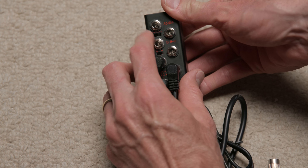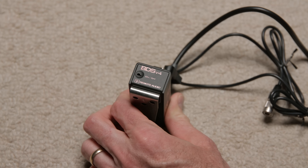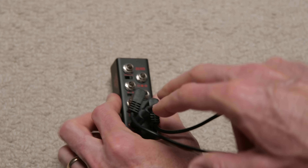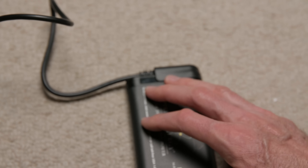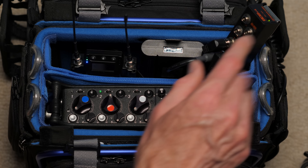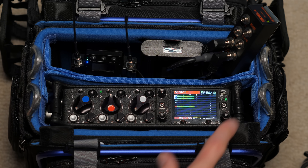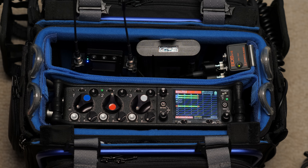A couple of other features: you can tell the BDS what type of battery you're using — whether it's lithium ion, lead acid, or nickel metal hydride — and it uses the color of the switch to indicate battery status. I also have a readout showing four out of five segments remaining. There's a switched versus unswitched output port, so when you turn the switch off, that unswitched port still gets power — I have my mixer hooked up to that, so at lunchtime I can keep the mixer on to retain timecode without running the wireless. It also prevents overloads and is designed to make it very difficult to accidentally short anything.